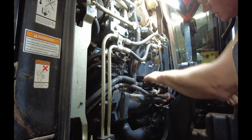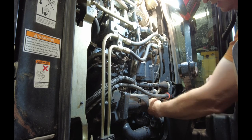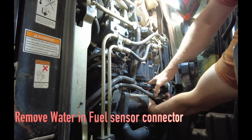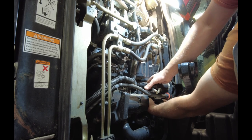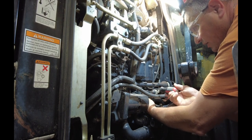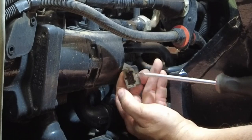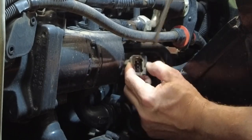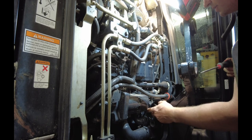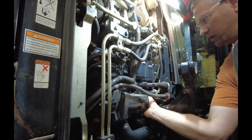We've got two fuel filters here, one of which has this fuel water separator on it. As I understand it, you push on this little clip here and that allows you to take the water in fuel sensor off. I think I can more effectively push on it with a screwdriver, because it is just a spring clip, and then pull it right straight down. This guy right here is the spring clip — when you push that in, the little clips at the bottom and the top release themselves and it lets that wire come off. Pretty smart. Let me go ahead and move that out of the way so I don't get a bunch of fluid on that connection.